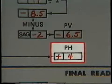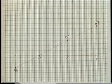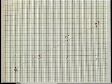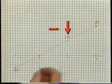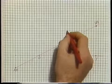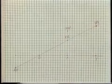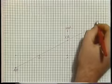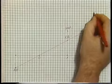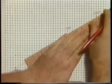Next, we need the value of PH from the data sheet. In this example, it has a value of plus 4 mils. Starting at point XA, we'll have to move up or down to plot the parallel misalignment information. If PH has a negative value, we move down from point XA; since PH has a value of plus 4 mils in this example, we'll move up from point XA 4 increments and place a point labeled XAP. We'll do the same from point YA — moving up 4 increments and making a point labeled YAP. Then we'll draw a dashed line that intersects points XAP and YAP.